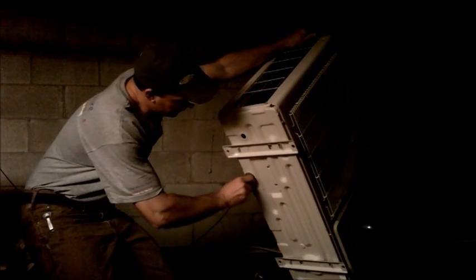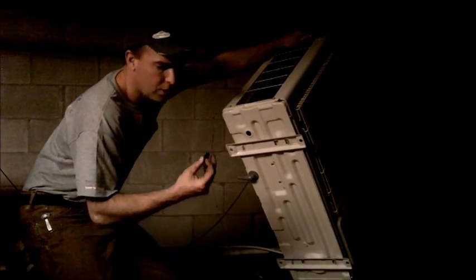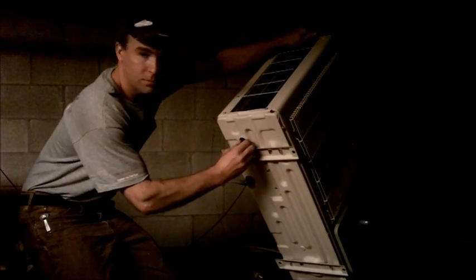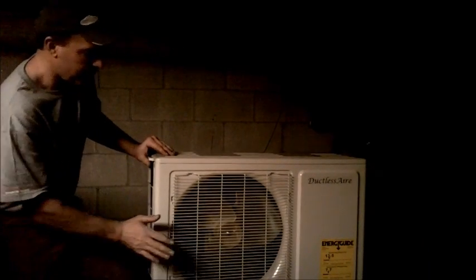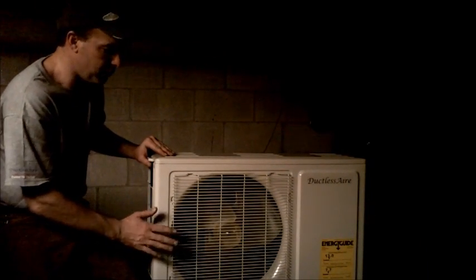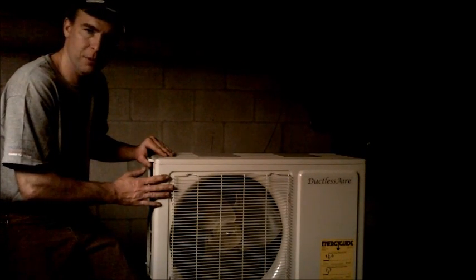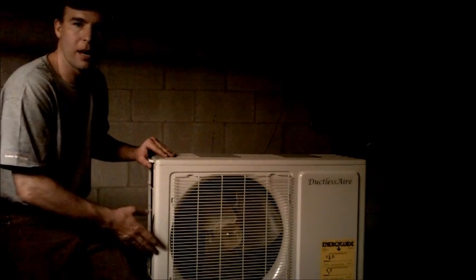For my particular application, I'm going to install my drain tube right in the very back — it just snaps right in, rubber seal around it — and then my plug will go into the other hole. It just pushes right up, tight seal. Also, we're not going to put it in a pan today just to get it done, but we'll also put an auxiliary pan up under this machine. That way, for safety purposes, we'll catch any condensate that's not caught by that drain.